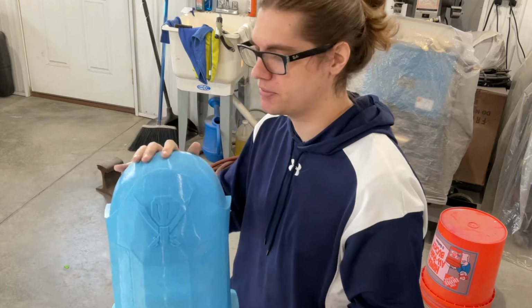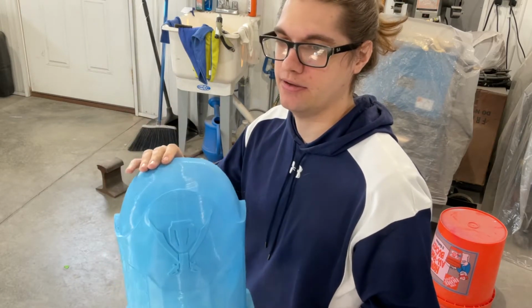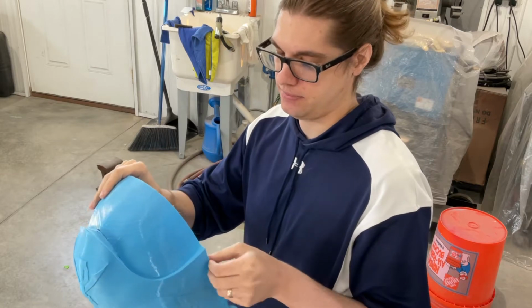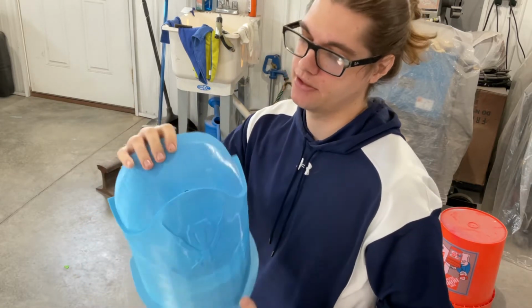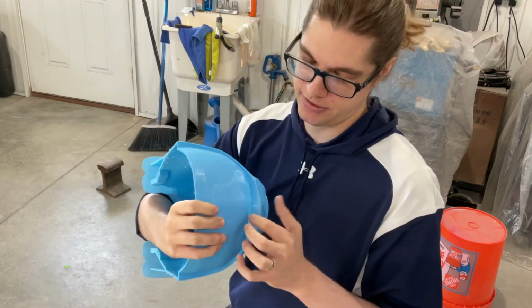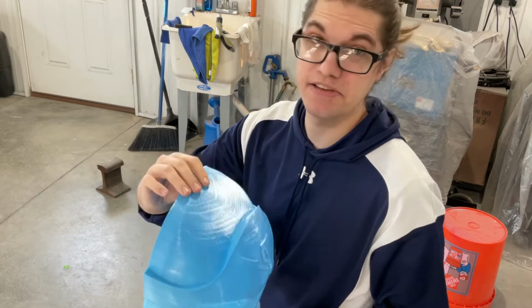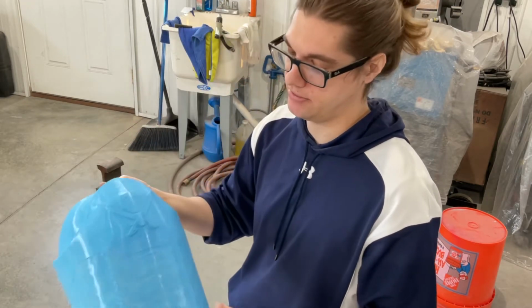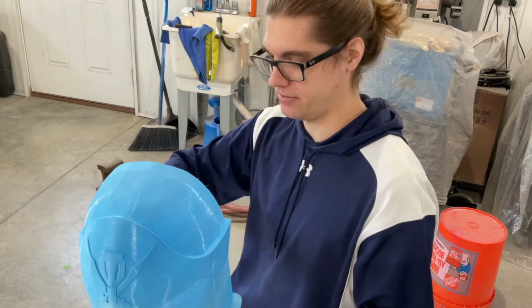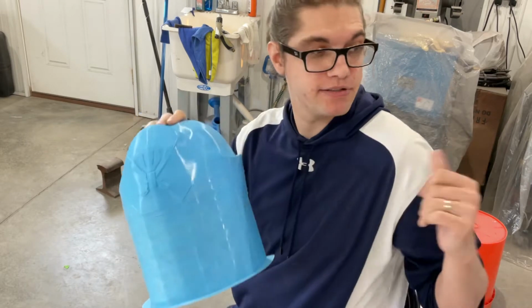This is finally finished printing. I think my tubing on my printer started slipping out of the fitting while this was finishing the top. So I got a little bit of under extrusion here and here, and the top's kind of not nice. So we can fix that. We'll patch that up. Won't be a big deal. Everything else I think turned out nice. Again, didn't take the supports off yet. And the back is actually still printing.